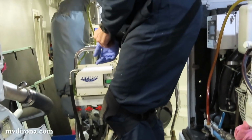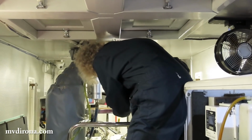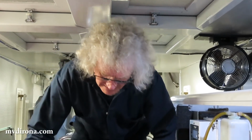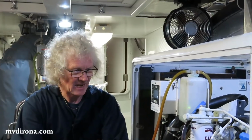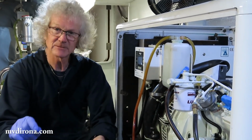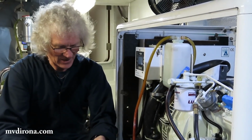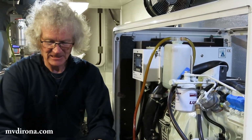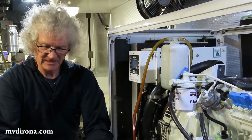So you haven't found anything that could indicate any other problems with the engine itself that would cause the valve seat issue? No, basically everything I've seen looks absolutely perfect, except for little bits of erosion and corrosion. Not very much, but a little bit in each cylinder, and it suggests that it's conceivable that it did have some water in it at some time.